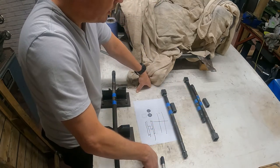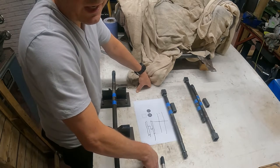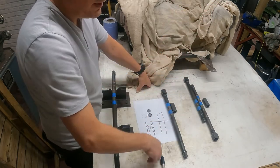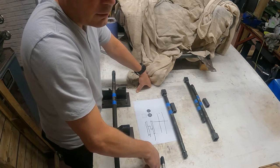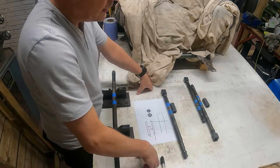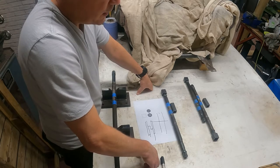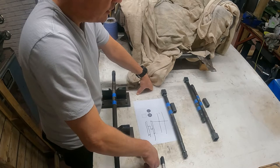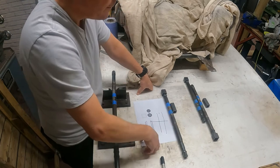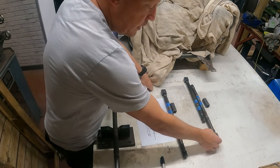I've obviously got the problem of machining a circle into a square, and I've got a milling machine. I've got something on the milling machine that will mill down metal. All I've got to do is control the rotation of the shaft as I'm milling it to make the cut end square. And my intention with that is, on the redundant end of each of the drive shafts I'm using, the four halves, I'm just going to blob on with a bit of weld just a slightly bigger square section.